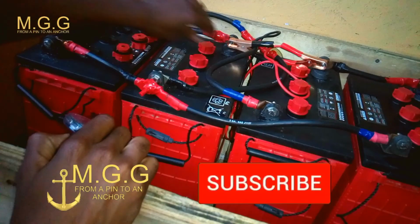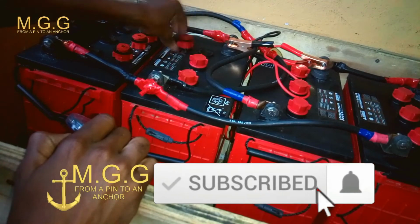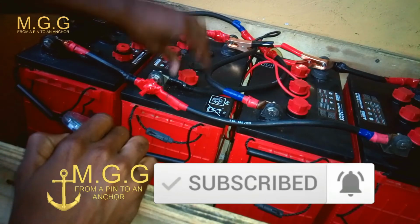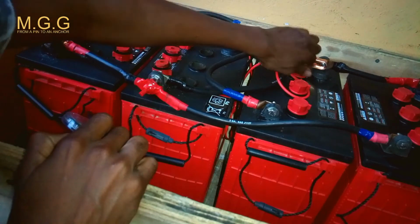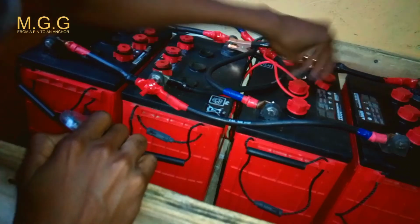These batteries are 6 volt Trojan batteries. They are 200 amp batteries. At the time of testing, those batteries were probably 3 years old, but they had heavy use and were not used in the proper way. A lead acid battery should not draw down 50% of its capacity. They were badly used because they have been drawing down too far and they are not charging back up properly.